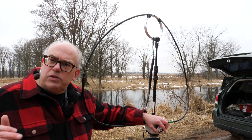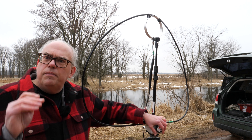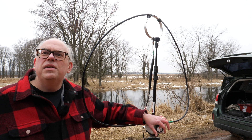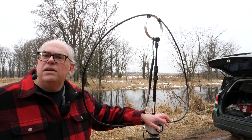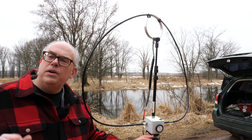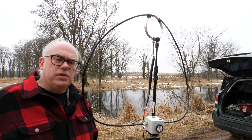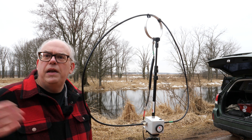One of the problems with this antenna on the low bands is that you really have to commit yourself to a frequency and tune it in, because if you go off that frequency by more than a few kilohertz you're going to have to retune the antenna. On 10 or 15 meters you've got a much larger window to work with, so you can move around a little bit more. That might make it a better choice for CW operation than for phone operation if you had to find that ideal spot to operate from.